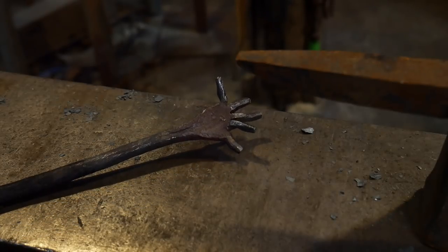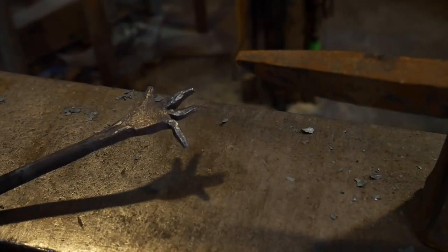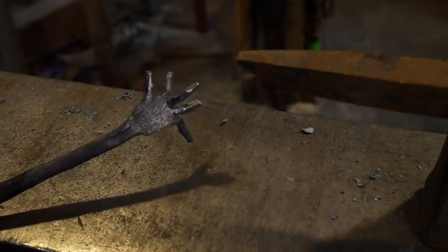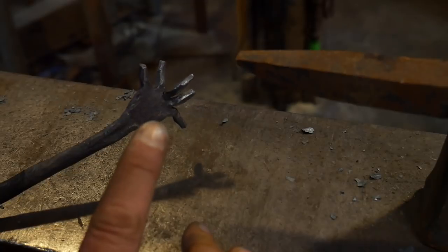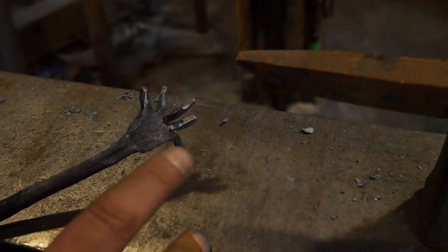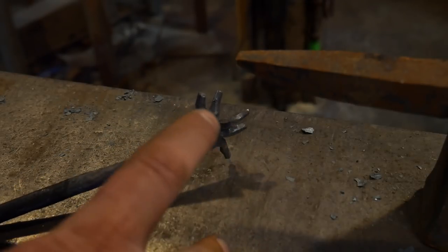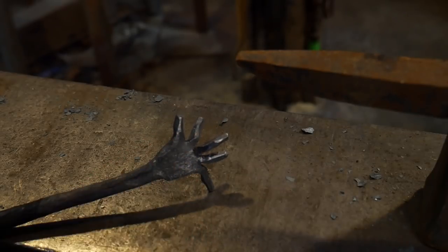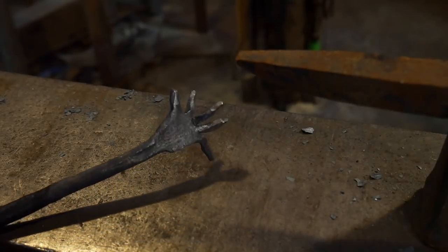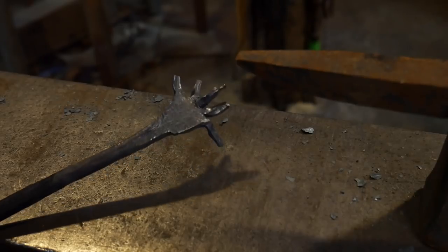Okay everybody, so here we are. Now we've got all our fingers mostly rounded up. What I'm going to do now is come back in here and clean out all those little areas down in the base of the fingers with a smaller file. I'll let it cool down a little bit and then come in with a small file and clean out all those areas. Then I'll take a piece of sandpaper that's stripped off and sand in between all the fingers and get everything smoothed up the way I want it before I bend all the fingers back into position. I'll be right back with you.